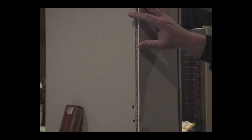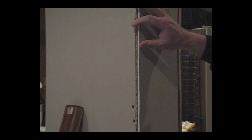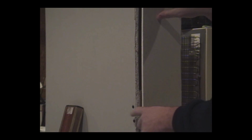At this point, our carpenter has framed in the arch that we'll be using today. We hung sheetrock over the opening of the arch and used a roto-zip to cut out the sheetrock. So at this point we have exposed studs. If you were going to be installing a 90-degree corner bead, it would be fine to run it somewhat flush out here. But since we're going to be using bullnose, you need to hold it back farther. That way the bead would conform to this particular corner.